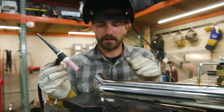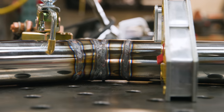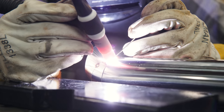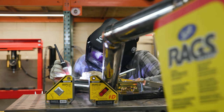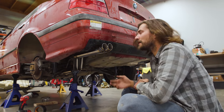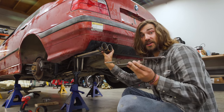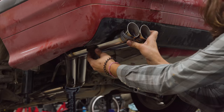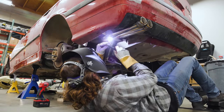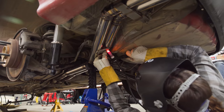Not bad. The most important part — we've got to make these somewhat pretty. I think we'll be able to do it. I've gotten a few that I'm not altogether too unhappy with. Moment of truth — well golly, that's an exhaust coming right out the back of the car! Now we just need to figure out how to hang it up. I've made an exhaust hanger — it's going to go right under here using the stock exhaust hanger points. I'll bring the welder over and weld this straight to the pipes. Two will become one, and I'll probably add another piece of stainless to join them and make it strong.